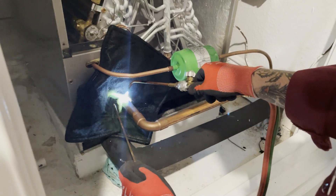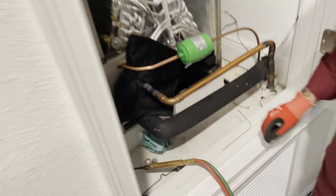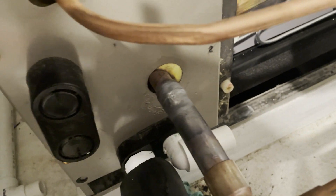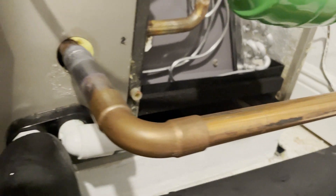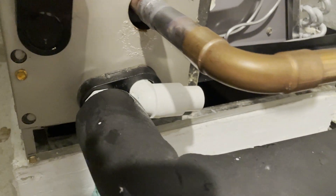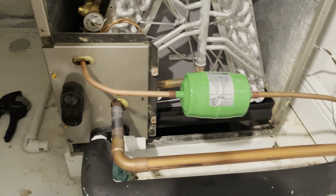Kyle, question on everybody's mind — when we pull the heat shield back, there's just going to be black, scarred, marred equipment behind there, okay? I guess nobody's asking that question. Let's see what's on fire behind here. Nice, look at that! As you can see, we're not the first guys here — this is an evaporator coil replacement. The previous braze got pretty hot, probably because this heat shield did not exist.